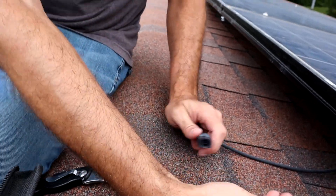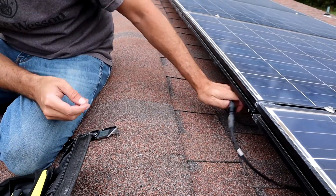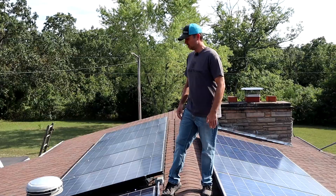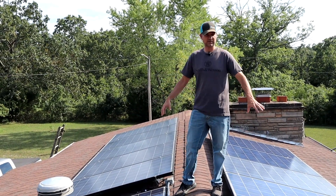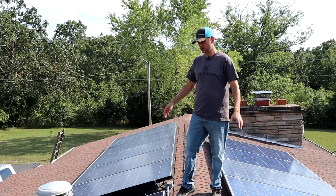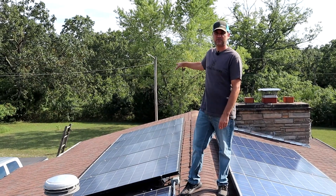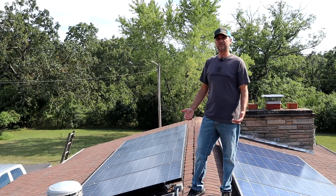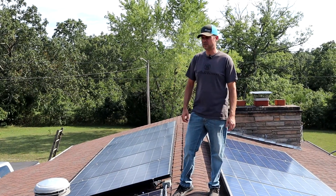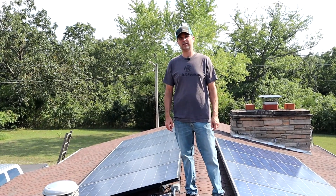Now because these are in series, I'm pulling my two ends in and I'm going to do some wire management and come back on that. We should be energized at the other end. We have both strings in — our east side and west side. Before any of the pros out there start commenting, the liquid tight stuff is going to be temporary until I have everything set up. This is just to get us going so we can play with the system, make sure everything works, and then I'll hard pipe it because I think we're going to put more solar on the south side of the building. If you're interested in this type of stuff — going semi-off-grid and protecting against power outages or worse grid-down situations — subscribe and check out our playlist with the rest of these solar videos.